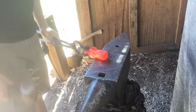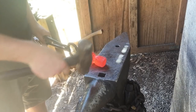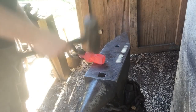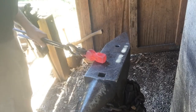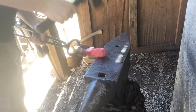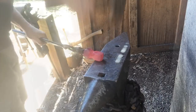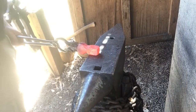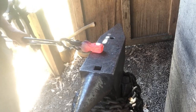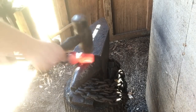I've got the door to my workshop open to block some of the sun so you can see what I'm doing a little bit better. Basically, all you need to do is forge out a square taper, carry it to a rectangle, and then knock down the corners. Using a good heavy hammer, I'm just going to turn with every stroke, and just keep working it down. At this point I'm just using the horn of the anvil to draw the material out a little quicker.